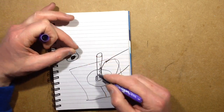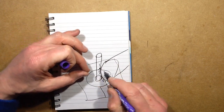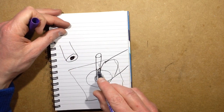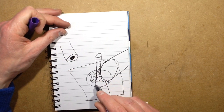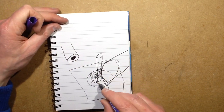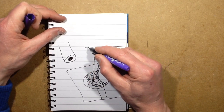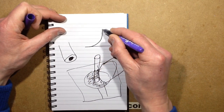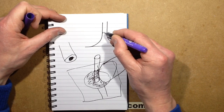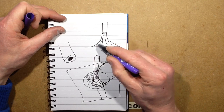And what happens when you apply that, you'll get the sizzle and you'll see the sort of clear liquid run out, and that's the flux melting. And what it does is it cleans the surfaces, it prepares them basically for the solder, it flows over all the surfaces, and then the solder melts and then it flows over. And when you've made your joint, what you should get afterwards is this perfect sort of curve up to the component lead as the solder flows up. And there's a slight join there, and it should be this lovely, perfect joint.